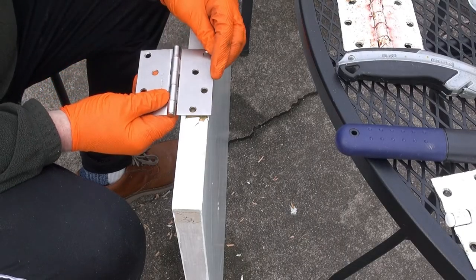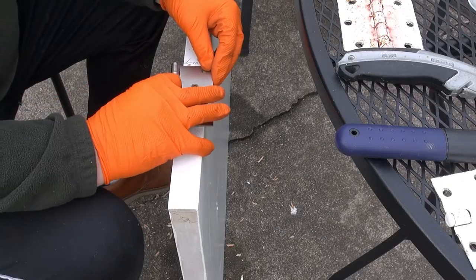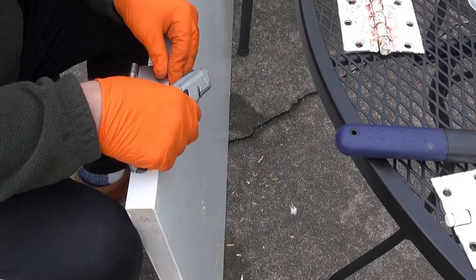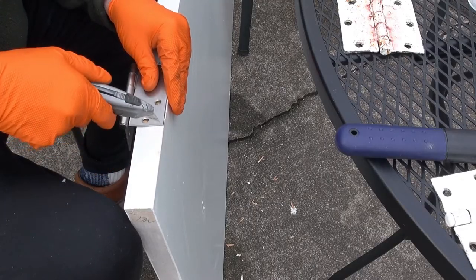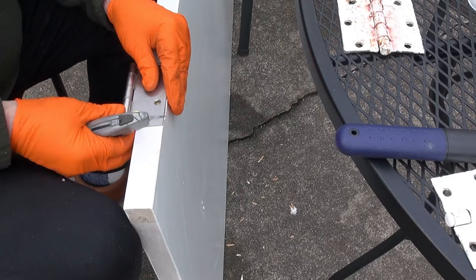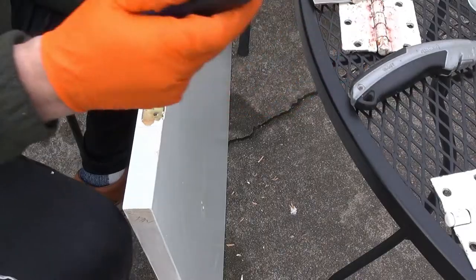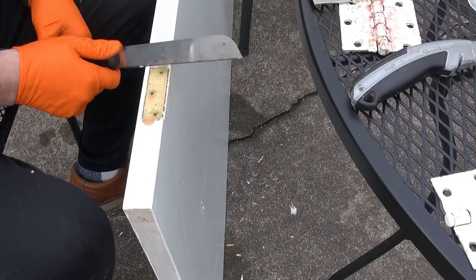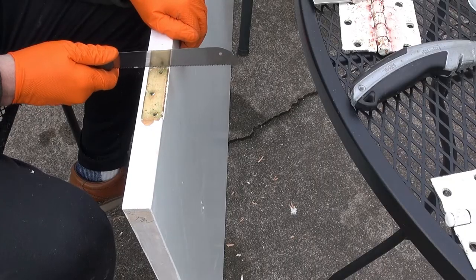The new hinge goes in that fashion. Since I've got a chip out here I'm going to put it to that side. First I'm going to mark where I need to cut using my knife. I'll be removing all of this area here, and I'm going to use the Japanese pull saw to quickly get that down. It only cuts on the pull stroke — the teeth are designed that way — and it gives you pretty good control over the cut.